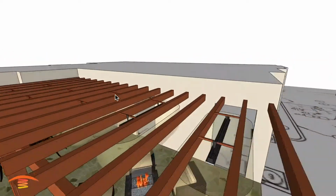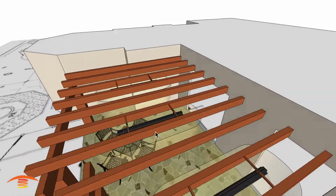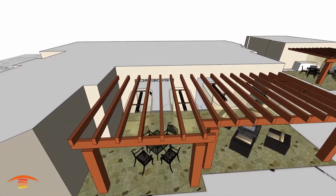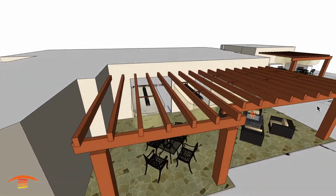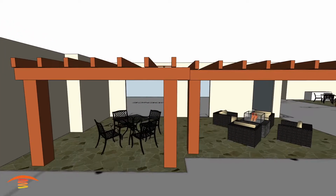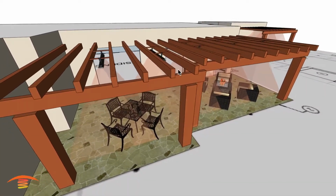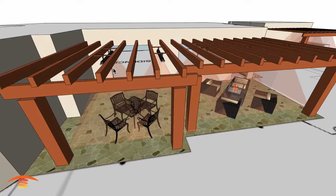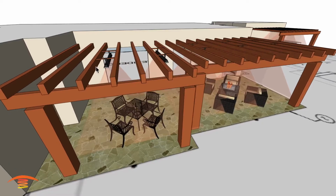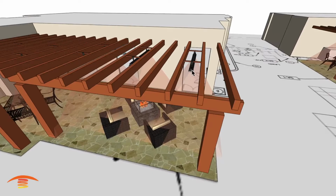This unit here I've taken and just moved it so that it's 24 inches further to the left, so that if in fact the seating arrangement is a little bit off as far as away from this doorway, that way you get a little more heat in the space that you're looking for. So let me turn off that and look at the actual footprint of heat itself. And you might also notice that I've placed these, between, you've got the heater, 1 beam here, 1 beam here. So there's 2 openings, a skip, and then 2, skip, 2, skip, and so on.